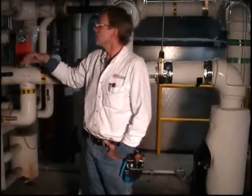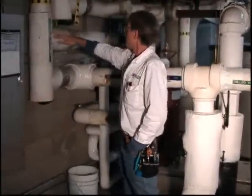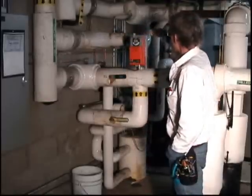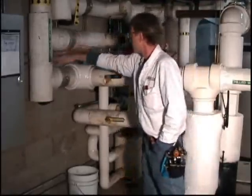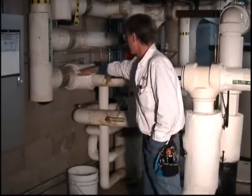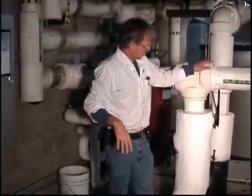Above on that system diagram, we're looking at specifically where the water comes back from the roof. Some of it gets diverted through the tanks and through that line, which comes back to this three-way valve. The rest of it bypasses the tanks — right there is the tank bypass — and heads over to hit these pumps.